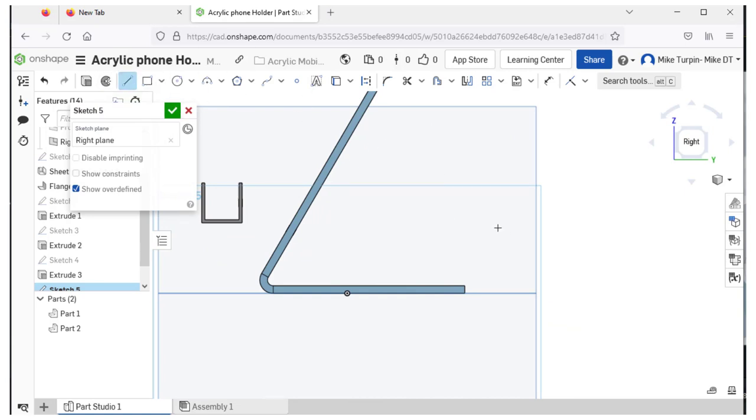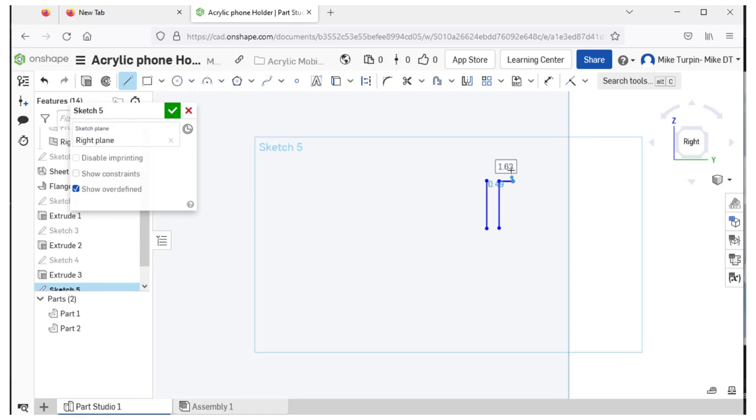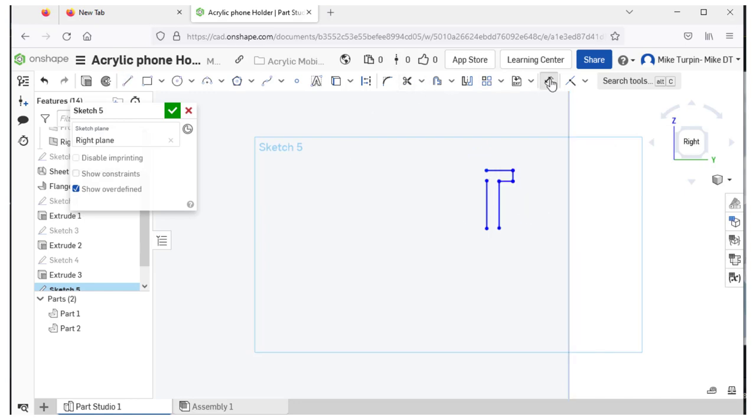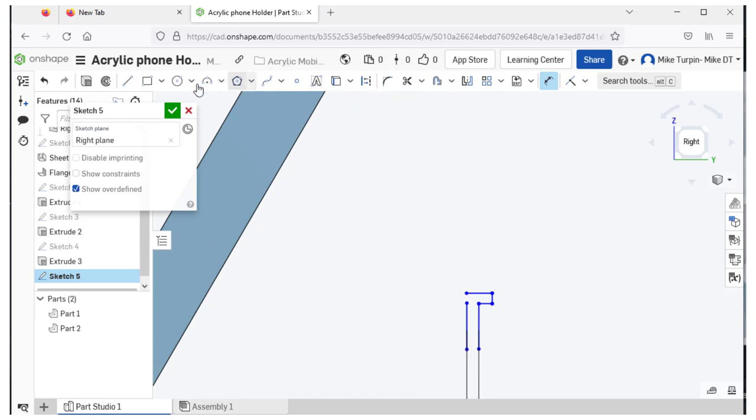I'm going to use my line tool. I'm not worrying about where it is in position, I'm just doing it so I can see it. I'm going to draw up. I'm then going to draw another line next to it, up, and make like a little T shape here. Right, and I'm going to put some dimensions on that before I get too carried away. Right, click there, and that dimension is going to be, let's make that 0.5. Where's that gone? There it is. Right, so the dimension between those two is 0.5, half a mil. I'm going to just close that up. So that's going to be my wall thickness of my rivet. Okay, then here, I'm going to just take this line and join it up there, hopefully. Is it going to do it?